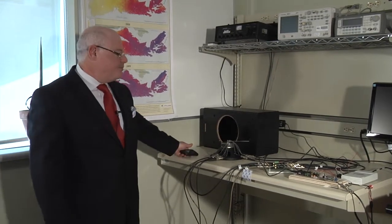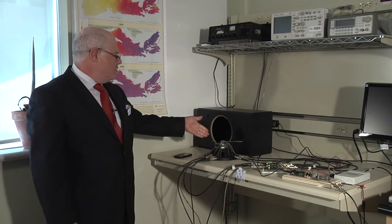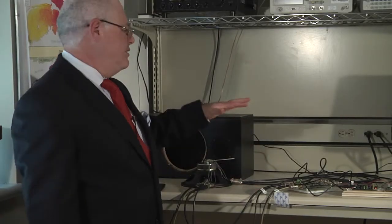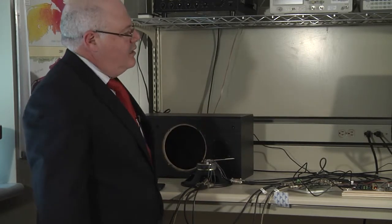So to briefly summarize, what we have shown here is the capability of our transducer, which is a very simple, inexpensive, robust transducer, to detect a variety of vibration events based on knowing the normal vibratory signature of this environment, of this room, of this floor, of the speaker and everything else. And what we were able to demonstrate is that a departure from this normal environment was able to be detected and classified, at least in the low frequency, high frequency sense, general fault versus only high frequency fault.